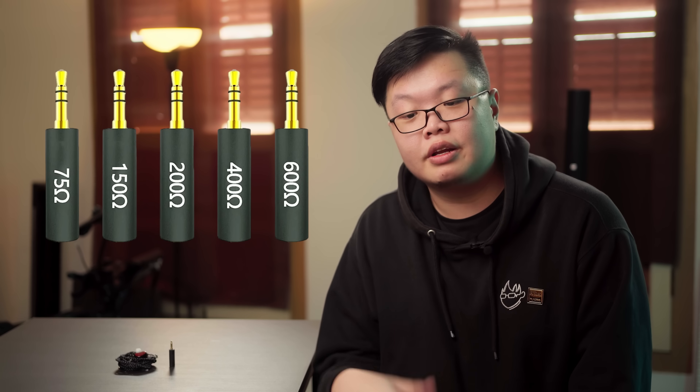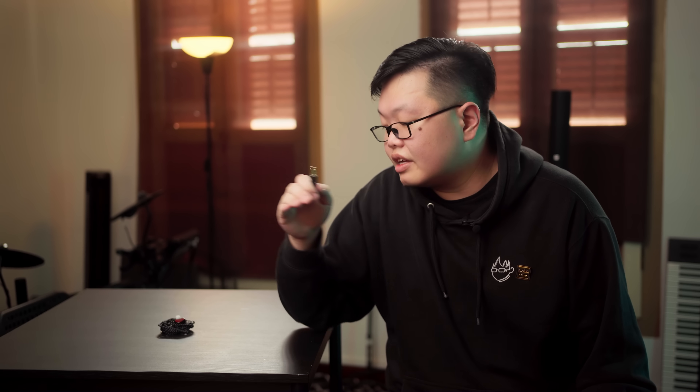Ten ohms is a nice baseline, but if you want higher values you absolutely have the choice — just go online, buy whatever you want, and use it. It's compatible and easy. As for how it works: changing impedance results in changes depending on the impedance curve of the particular IEM. Since this IEM uses two different drivers with different impedances, stacking on a resistor attenuates each driver at a different rate. The 7.8mm full-range driver gets dampened at a higher rate relative to the 10mm subwoofer — which essentially just means bigger bass. Bass boosted. There you go.